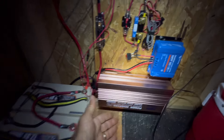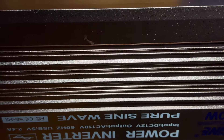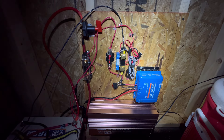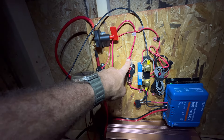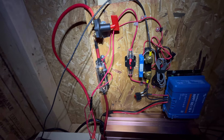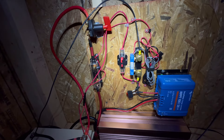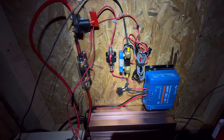This pure sine wave inverter is absolutely amazing — it's on and you can't even hear it. That's it. It's a very simple setup, but remember: your power and your fuses should be in a particular order. Refer to online diagrams — I've got my own diagram. I've still got a bunch of cords to sort out, but at any rate, it looks good.